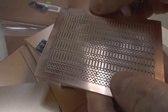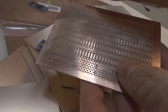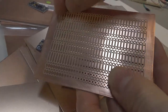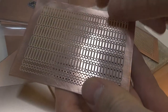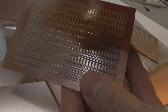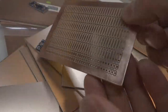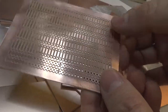What I decided to do instead is just take this directly into Fusion and make it there. In Fusion I made one of these little pads, extruded it up with the holes in it, then patterned it horizontally. That got the job done in like two seconds — what would have taken me a whole lot of poking and placing in KiCad — and then I added the bus bar system. From there it was just developing the 2D contour and sending it off to the mill.